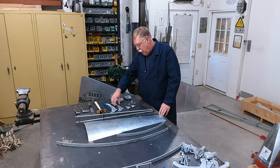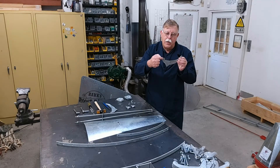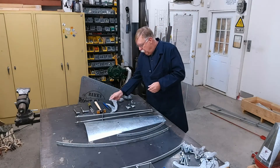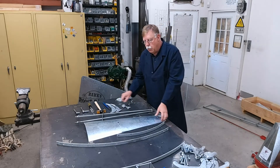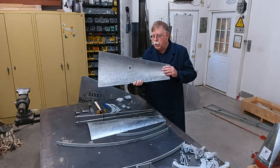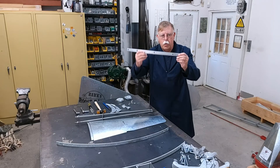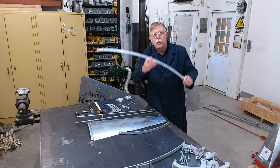A couple of things you're going to need: nuts and bolts, the sail ribs — and if you look carefully you'll notice that on the end it has a built-up edge. We're one of the few people that still do that because we hot-dip galvanize everything, so this goes into molten zinc and comes back out. Then these are the sail clips, also hot-dip galvanized. People technically call these the blades, but we like to call them the sails. You can see the sail has a rough surface, a clip, a hole, another clip, and a tapered edge. This is the inner wheel band — the inside small wheel band — and this is the larger outside wheel band.